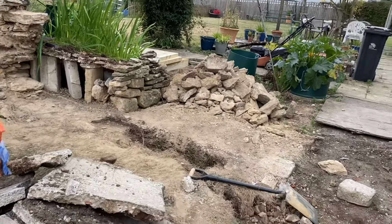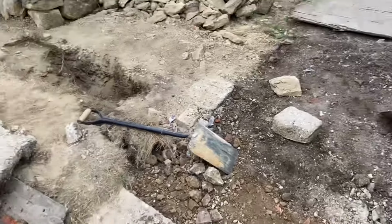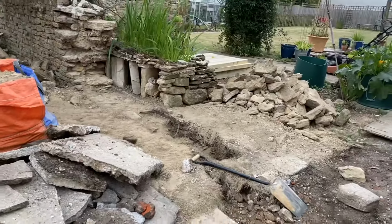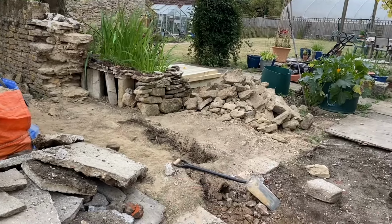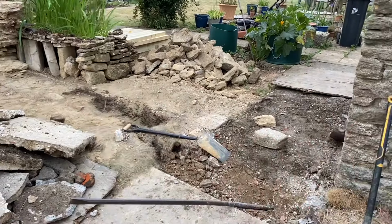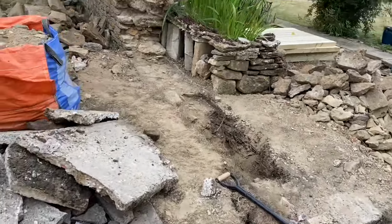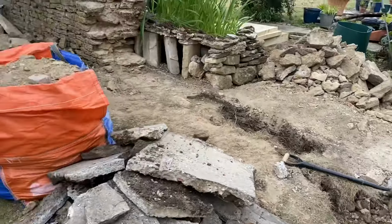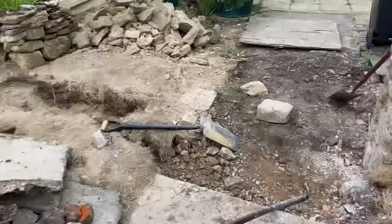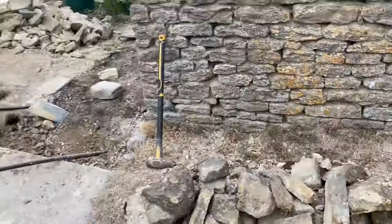Then you've got it perfect, it's a lot easier building up to a gate post already in, because then you've got your perfect measurements, because I don't know what hinges are going on there, what furniture and stuff's going on the gate, so I don't know if there's going to be a gap between the post and the thing, whatever. But till our chippy bloke gets here, I'm just going to play it safe and step it back, and everyone's happy then, and that'll do for today, and then crack on with it tomorrow. Right, anyway, let's get a mix knocked up and get going.